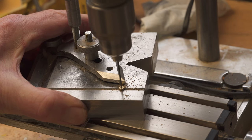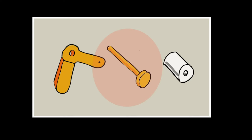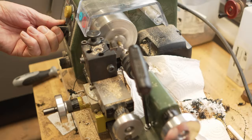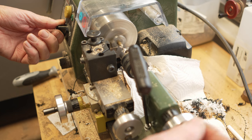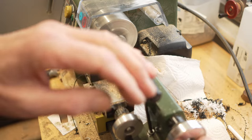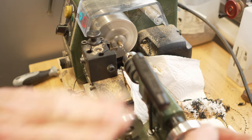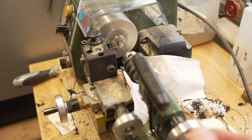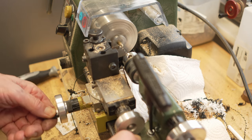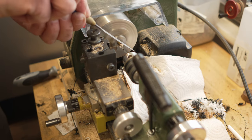Here I am doing the same with the little anchorage pin as well. It's got nice holes there. Right, now let's look at the pin that holds the actuation rod on. Here, using a Proxxon PD 250 lathe, a small lathe, very handy for this sort of thing and easy to lift on and off the workshop table, using 6mm brass rod. Here we are drilling a 2.1mm hole in the end, just to make the top of the pin.